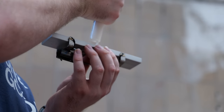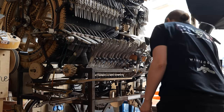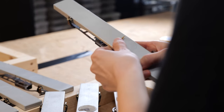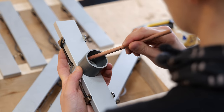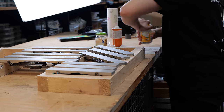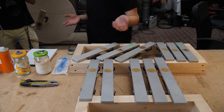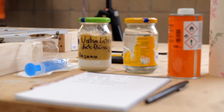We had applied latex pads on vibraphone plates that we didn't have yet. We had a bit of use of them and it turned out that some had to be replaced. For that I first had to take off the pads we had applied, clean the surface again, draw on new placement marks, and put on new latex pads. Marius and I conducted a couple of tests with different mixtures of latex and water, and it turned out that a 50-50 mixture with the Laguna latex was the best.